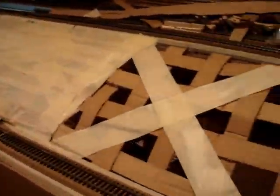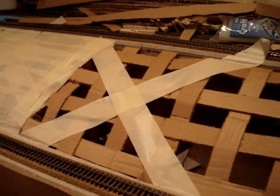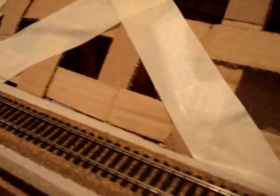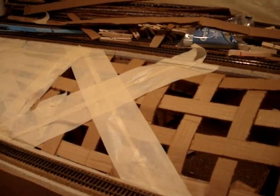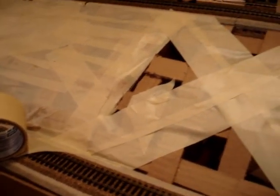A little bit more on the application of the masking tape. Call me anal retentive, but I've decided that going on the diagonal and crossing is the way to go. I also try to keep up with the ditch line on the edge. You can just let each piece go in with a slight overlap and then take a little time to feed the tape down as you go, keeping your ditch lines intact. This hopefully gives you plenty of room when the paint and plaster go on over the tape. Then add another strip going either direction until you begin to fill up the gaps and then you can go forward.